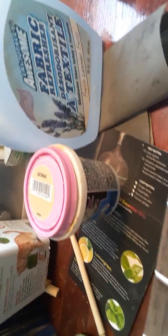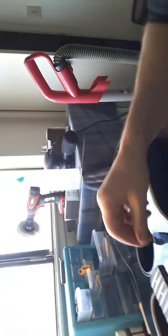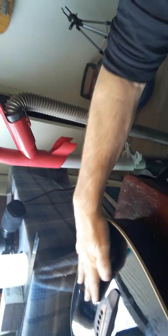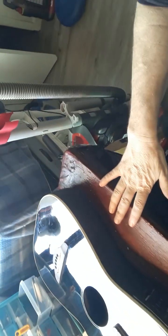You can see in there — I went nuts on some of these fret ends. They look like diamonds — never mind rounded. As you get up to the top it's a little messy. But I was pushing down, right? You get the bulge in the back and the dip in the front, and so the bridge kind of comes forward. Now you can see I pushed down in the back — even though it's just the body. But if I take the straight edge, there's a huge dip. I kind of messed up the guitar. I knocked the support out, now there's a dip in the body. But I imagine as the strings are on, the tension will pull the body back up. And the belly bulge might come back to level.